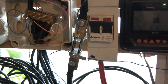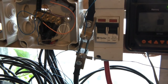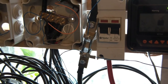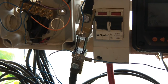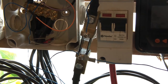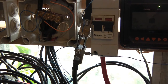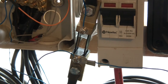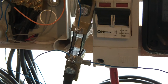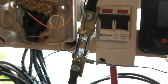We've come down to here and you can see that I've put in a current shunt — a 200-amp current shunt — and I'm going to use that to measure the current flowing from the batteries to the inverter. I was using an ACS758 but it didn't last. I had it in place for a few months and it just stopped working. So I thought I'd keep it simple and use a current shunt, although reading the output into an Arduino isn't 100% simple itself — however, I'm working on that.